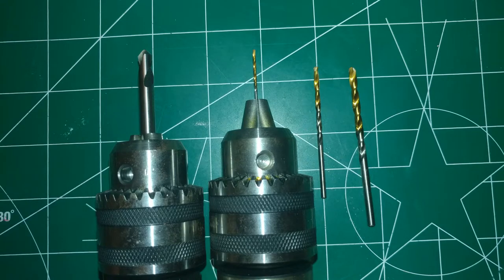Next are the drilling bits. I'll share feeds and speeds in the videos that show the drilling operations. What you see here for tools from left to right: a 45-degree two-flute spot drill; next is a #58 drill for making one-millimeter holes for the various components; then the #39 drill, which will make my two-and-a-half-millimeter reference holes — we'll use these holes not only to fasten the board down once completed, but also as a reference point for flipping the board and milling the back side; and finally the #28 drill for the three-and-a-half-millimeter conductor holes. Note that the drills are all high-speed steel jobber drills, titanium nitride coated. All of my drills came with my Tormach — you can find similar sets on their website if you're interested.